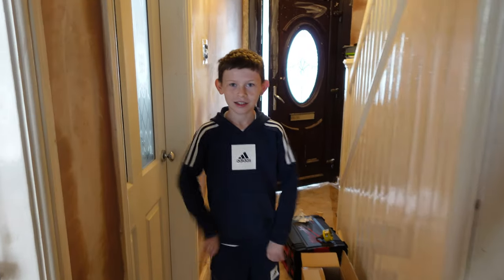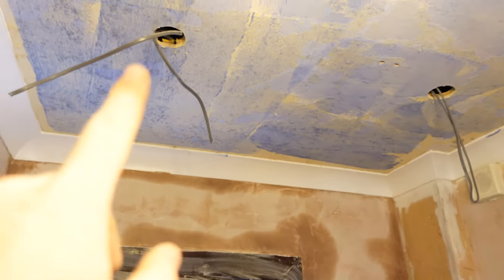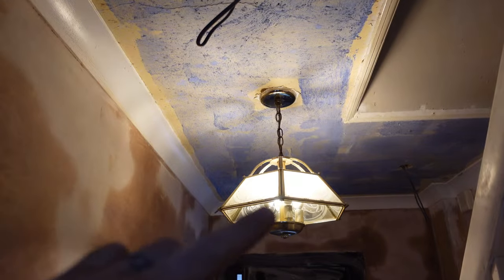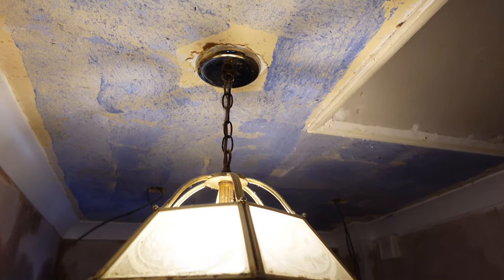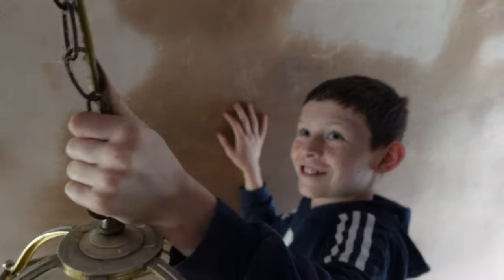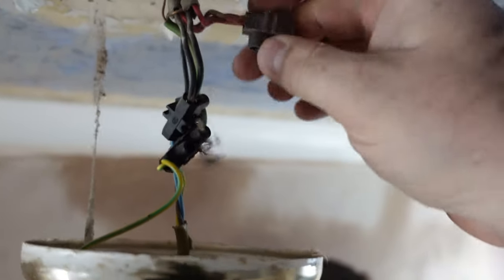One bonus to having James here — getting my hands up in holes. He's got them wired now. We've got a loop here because I had to push from this one, then two ends there, two ends in the middle, and the end one I've already connected the spot up. I'm going to leave them in the ceiling — it's up to the plasterer then to drop them down and pull the bezels off if he wants. The first point on the lighting I've taken to just above here. I'll get the spots connected up, drop this fitting down, put the joints in a wago box just above there.